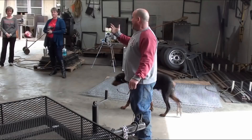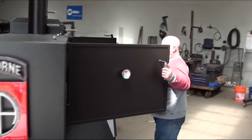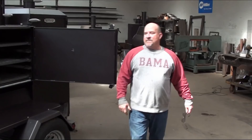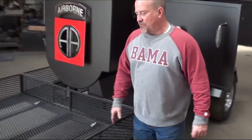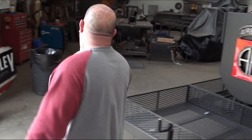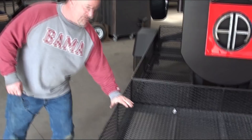Something else worth mentioning: it's got gaskets on this side, as all our cookers do. Starting now on our baskets, instead of using three-quarter tubing we're using a half-inch hot-rolled bar. Longevity-wise it's going to be a lot better — it's stronger. I go back and wish I had done that years ago. It's styled well and we like that; it's got a good look to it. That's what we're going to do from now on — it's just much better.